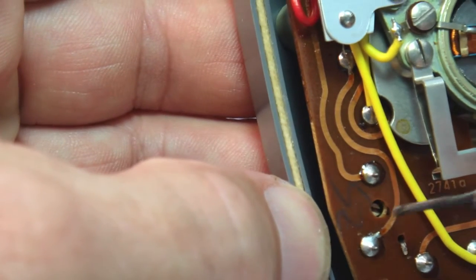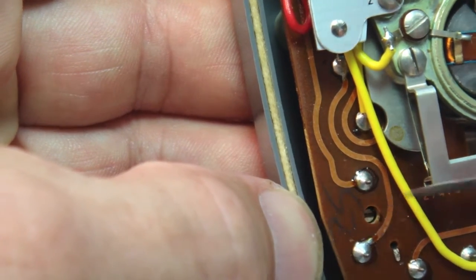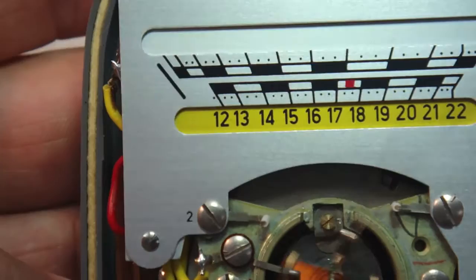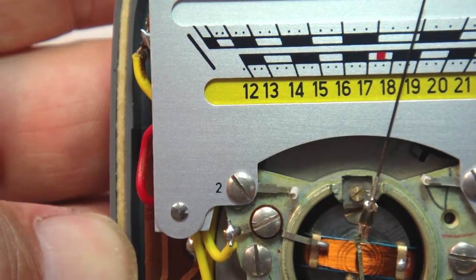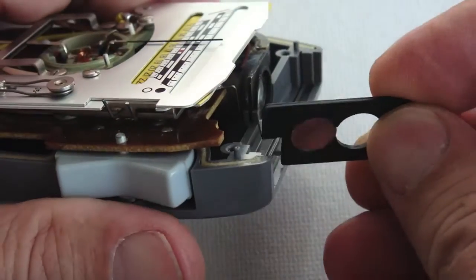The position marks will be helpful as a zero starting point as you make adjustments to try to tweak the meter in. A good working meter or calibrated light source is essential to compare the settings in order to bring the meter in if adjustment is needed. Once adjusted and satisfied, it's time to reassemble.